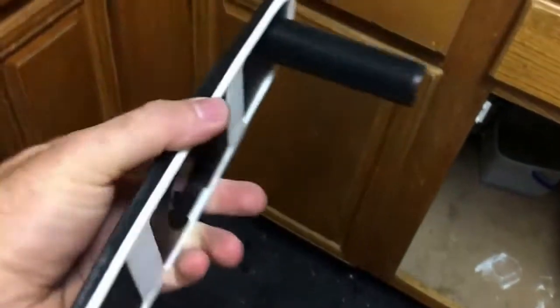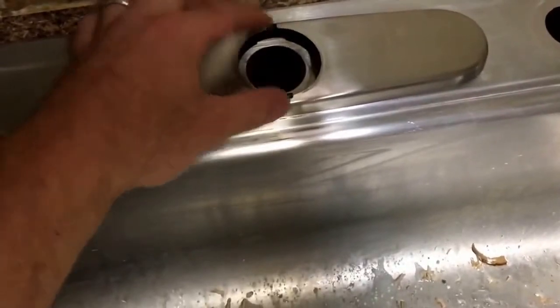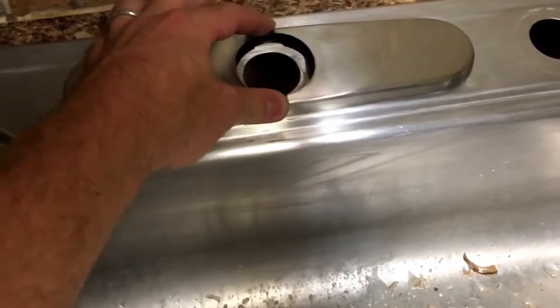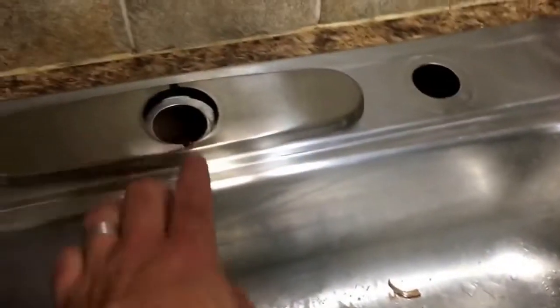Okay, let the games begin. We've got our initial three-to-one conversion piece. This just drops in just like that, and then we've got our collar that's going to go over it. It's got two little tabs that match up with slots in the base of your sink fitting so that your whole sink base doesn't try to rotate whenever you rotate the neck of the sink. And then of course here's for our soap dispenser, which we'll do last once the sink's all fixed up.